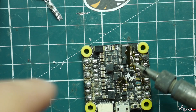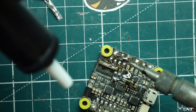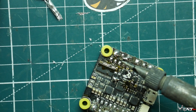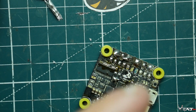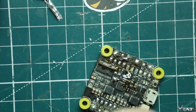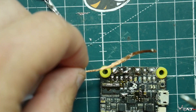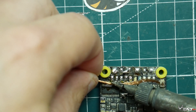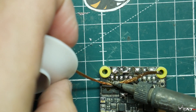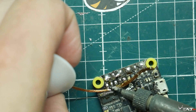You can also try — for instance for something like this little thing right here — using the solder sucker, and it might work. But the best thing for that will actually be to use some of this: this is soldering wick. What you do is pull some out — it's pretty much like fine wire interwoven together. You take it and place it on top, then heat it up with the solder underneath. Just make sure you don't touch it because it does get hot, and it will wick all the solder up — you can see the solder going onto the wick.